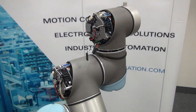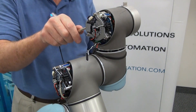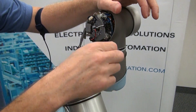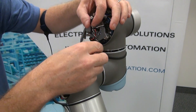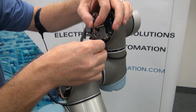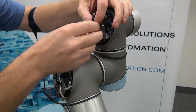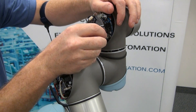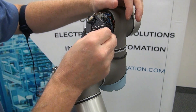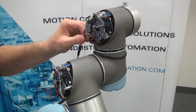We are now going to reinstall the electrical connections. Since we're making an electrical connection, we're going to reconnect our electrostatic dissipative wristband. We're going to connect the power connection first, paying attention to the orientation of the black and the red, followed by the communication wire — the black and white in the same order. We can then remove our ESD wristband.